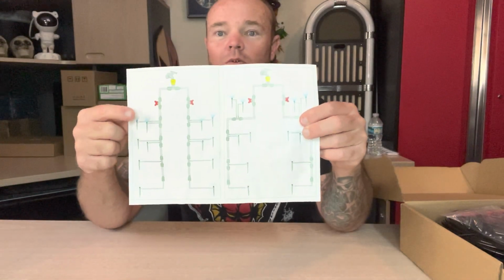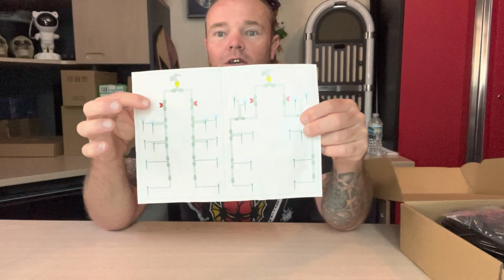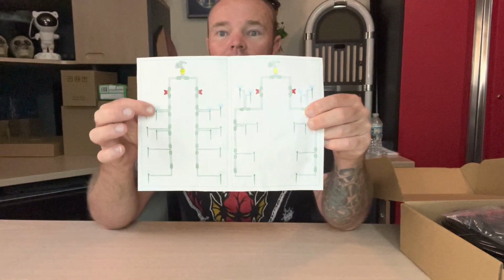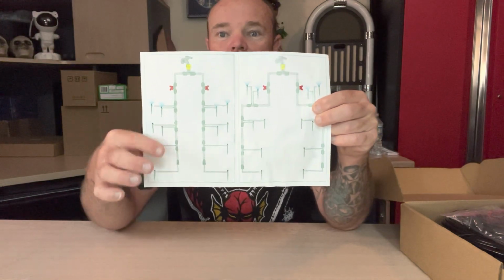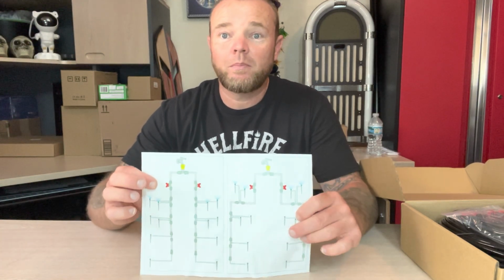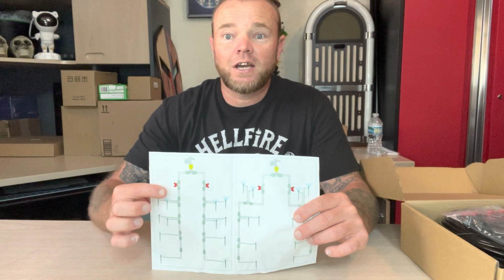And I just want to note, even from the factory, you'll see coming off each side of the main faucet there, they've only got 6 of these on each side. You get much more than that, but I definitely recommend only putting 6 of the fan or drip emitters on each side of the valve. If you go much more than that, they don't really work that great. If you stick around 6, just like the manufacturer says, they work perfect. I've got 60 PSI on water at my house, and 6 is just about max to make everything work correctly.